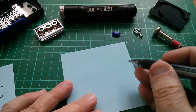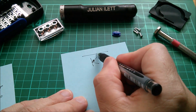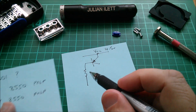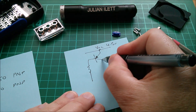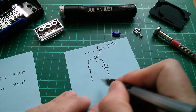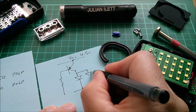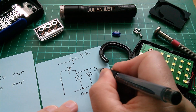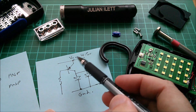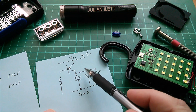The circuit for each of the two LED circuits is like this: we've got a PNP transistor, the emitter going directly to VCC at 4.5 volts, the base has a resistor - different in one circuit to the other - and the collector goes to the diodes pointing downwards to ground. The diodes are simply paralleled: three diodes in one circuit and 20 light emitting diodes in the other. If you put a low on the base, current flows from emitter through base down to ground, allowing a larger current to flow from emitter to collector and through all of the LEDs.